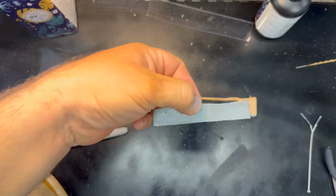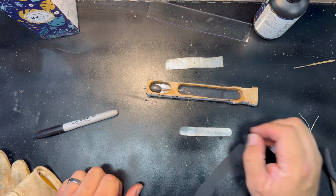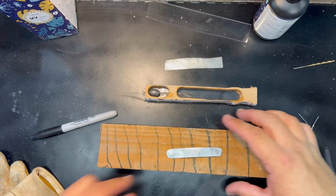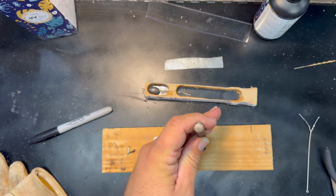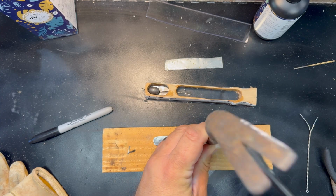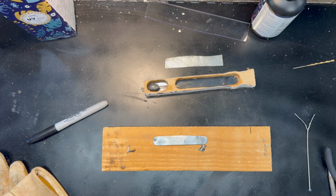After much grinding, we went from this to this, and this will fit in this. So now we need to drill holes in it so that we can attach it to the wire. Okay, we got out our piece of wood. Probably put it that way so we don't scrape up our new bench too terribly much. Center punch. We want it center punch right here. Like so. Beautiful. All right, great work.